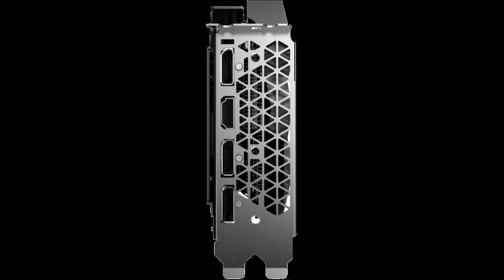It should reach above 1,800 MHz+, but be warned — please be very careful, as any overclocking is done at your own risk. We recorded temperatures of around 72 degrees Celsius, which is pretty high, but the Zotac Ice Storm 2.0 cooling along with the dual fans and metal wraparound backplate handled it pretty well.